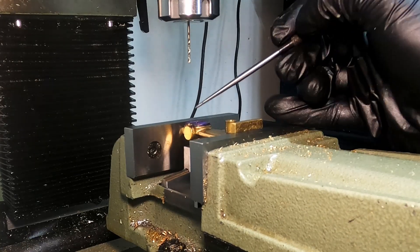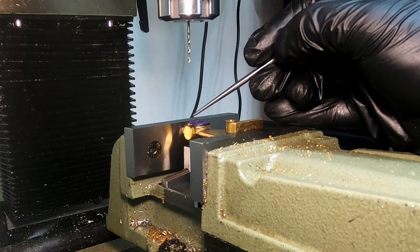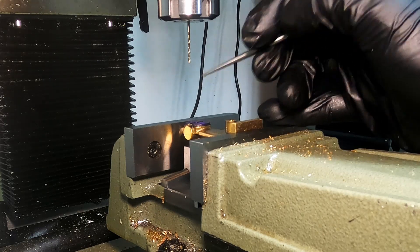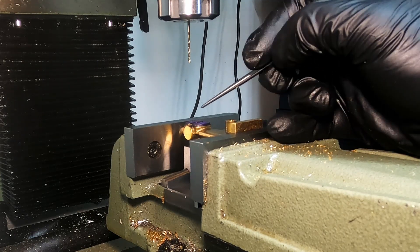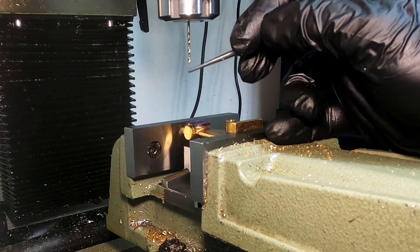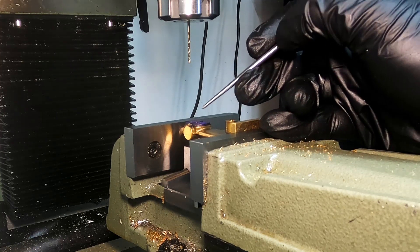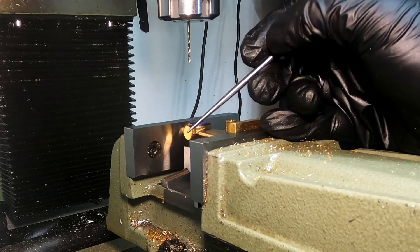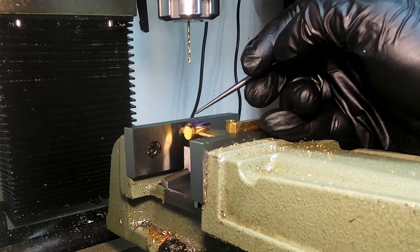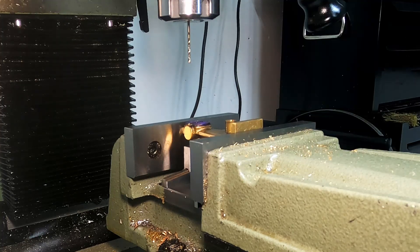I have calculated what the top two ports should be, and I will do the bottom two later. I think they have to be drilled at a slight angle to get into the passageways that have been drilled from above. What I am doing here is just spot drilling them with the correct size drill where they should be, so that when I come to drill at an angle to connect the ports up, hopefully it doesn't drift off from the location it is meant to be on the face — because you really need that to line up with the port on the cylinder.